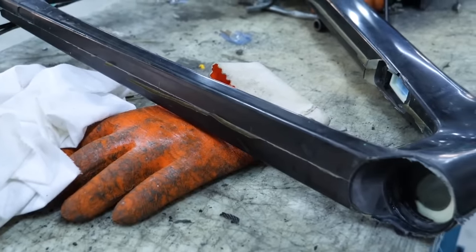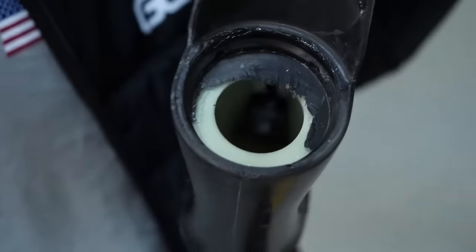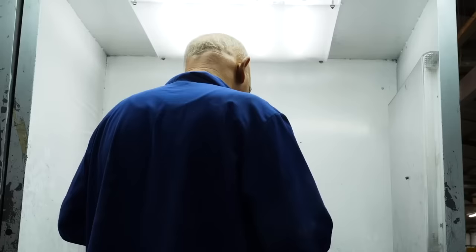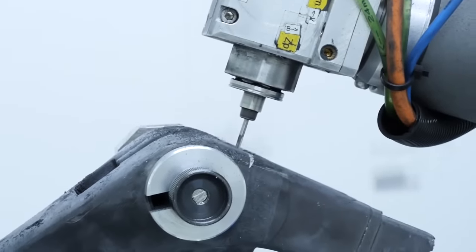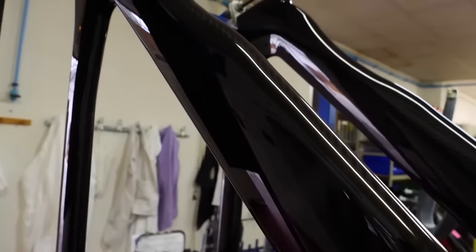And with composites, it's usually about the cleanliness of the materials during manufacture, the consolidation during manufacture. It's defects. So with delamination failure, for example, this fracture between the plies, that is most often caused because of lack of cleanliness or voids at the interface, which are themselves a stress concentrator. And so those will fail earlier. So quality of manufacture is a big thing in strength of composite materials.